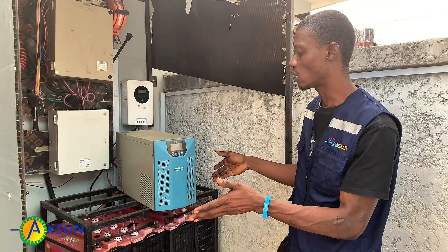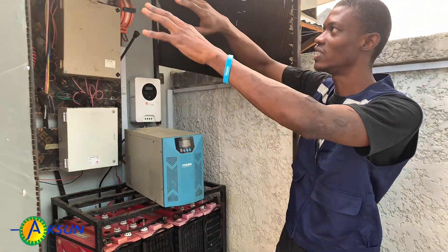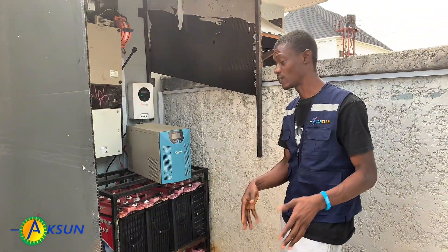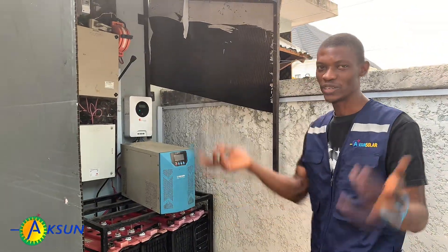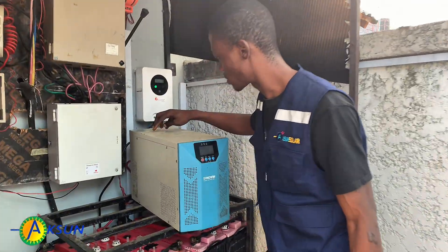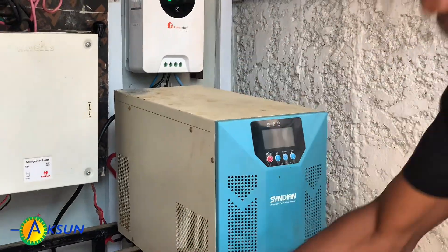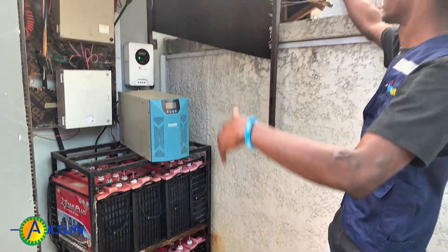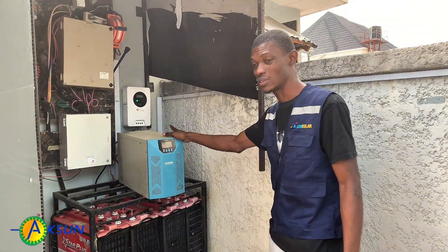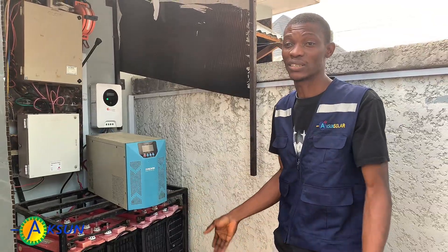Because this was a tubular system installed about three years ago, we decided to mount it in a housing outside. But now that we are going lithium, we decided we should bring it down inside the house. If you look at the body of the old unit you can see some rust and corrosion that has already been occurring. Even the battery racks show it — because when it rains, the water drips to this side and splashes on the system. That's what damaged the previous system, so we decided we are not installing this outside again.